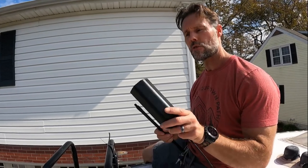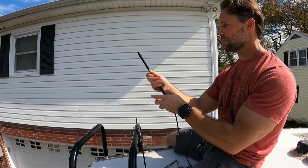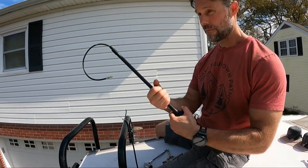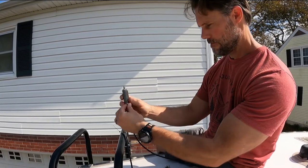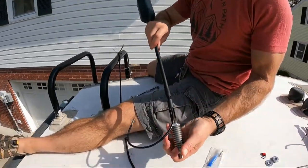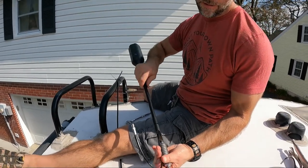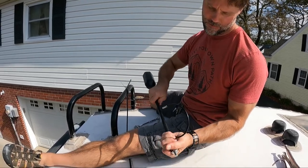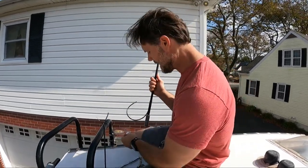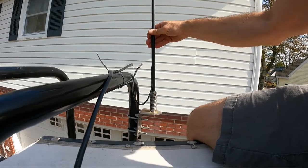We have our antenna, and I'll tell you, this is really light — feels like just a case of air. We're going to feed our wire through. Simple. Thread this guy. Now you can see why you need the side outlet. When you tighten this, just make sure you keep this wire sort of out and allow some flexibility, otherwise it just kind of wraps itself around the mast. A little lip on it goes face up on here and then face down into here, and it kind of seats into the bracket just fine.